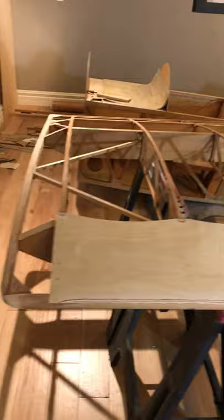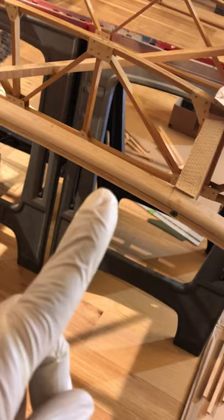Basically we have wing number two here and wing number one over here. This is the one that the previous builder had done, and I have finished off a lot of things on it. The leading edge skins were on, but we did the wingtip and all the wingtip bows. This is three pieces of spruce laminate soaked wet, bent, and we got the wingtips on.